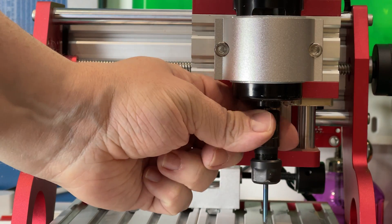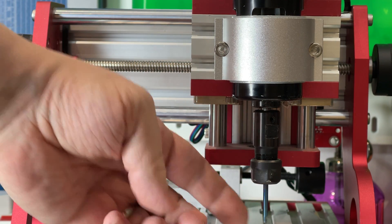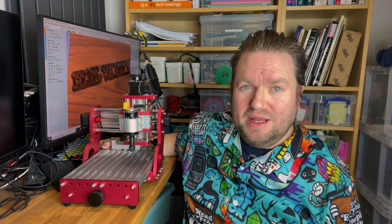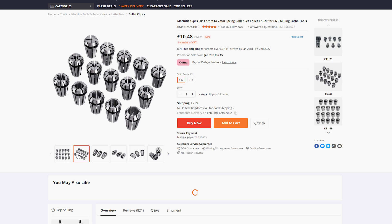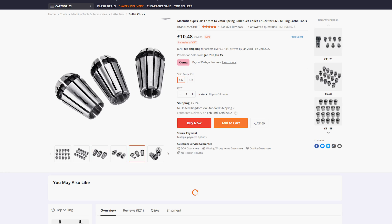The spindle is about 150 watts and will do 7000 RPM, so it's fine for the type of things you would cut on a machine of this size. It takes ER11 collets and comes with one that takes a 3.1mm bit — I've got loads of those for my rotary tool. Banggood do sell replacement collets and a good range of bits which I do recommend, and I'll put links to those in the video description below.